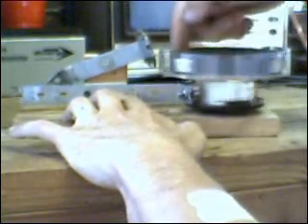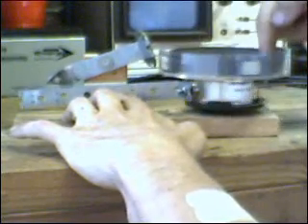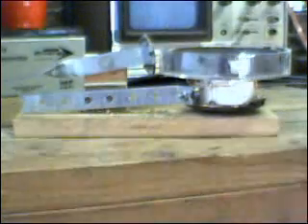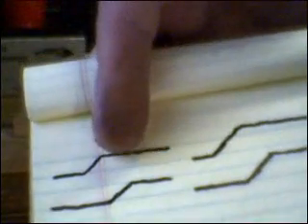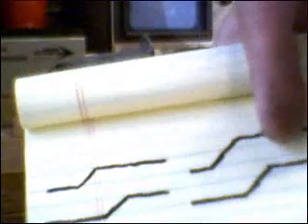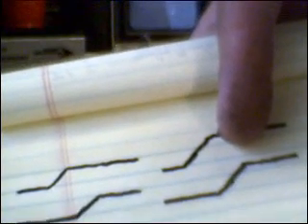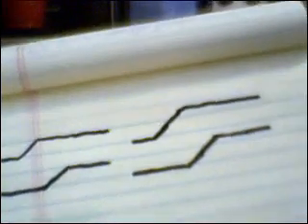But I don't think the amount of travel is going to be enough to actuate the stator — barely adequate. So I'll be sliding the bobbin off; fortunately it disassembles very easily. Whereas this was the original raceway, I'll be taking a wider pair of pliers and making the ramps a little bit taller, so I have plenty of room underneath the rotor to do that.